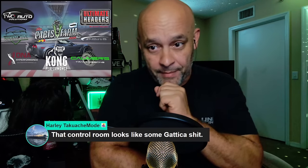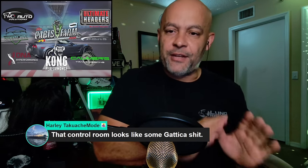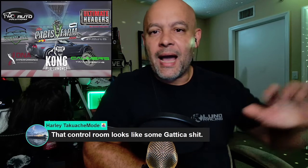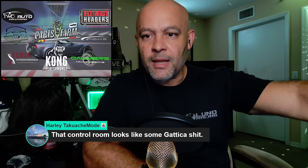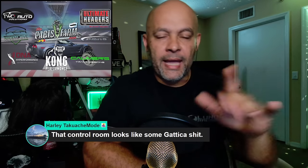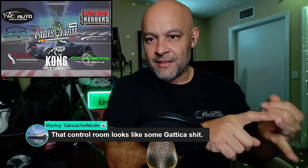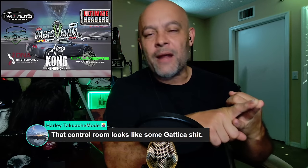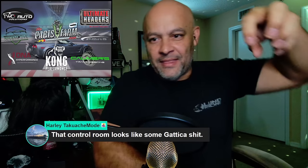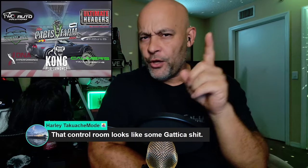This is what blows my mind. In one of the videos, I said, unless you have the machines, I don't trust that you did the work properly. And somebody said, fuck that. As long as I trust my machine shop and I check the parts after the fact, then that's better for me for assembly. Okay, so what if your machine shop has the spring testing tool, the five angle valve job or three angle or four, whatever angle valve job, the seat and the lapping and the spring static pressure that you're supposed to put on and shifts. Do you check that?